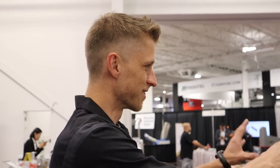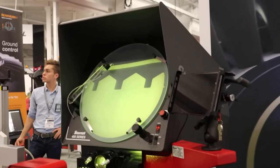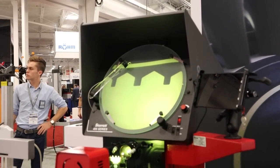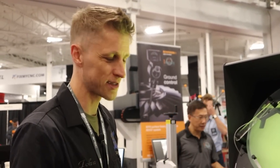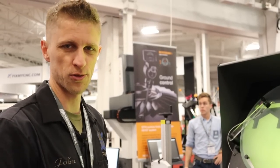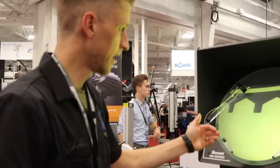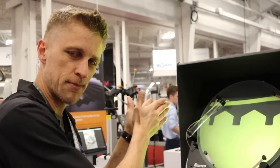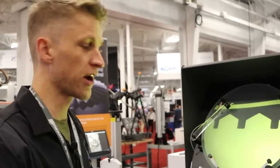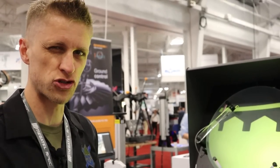Angelo and Sky came separately. I haven't found them yet, but Angelo wants an optical comparator so bad. I don't know much about them — I know how they work but I've just never used one. He's used them before and says we need one. You put your part in there and it's a shadowgraph, so it gives you a shadow, magnifies it, and you can measure distances very accurately. For some of the parts we do, it'd be very helpful.